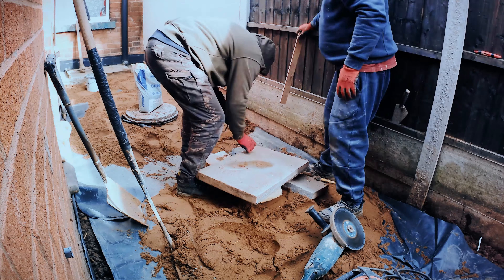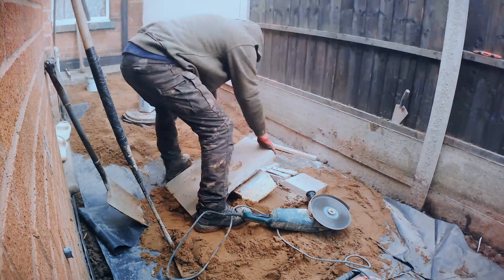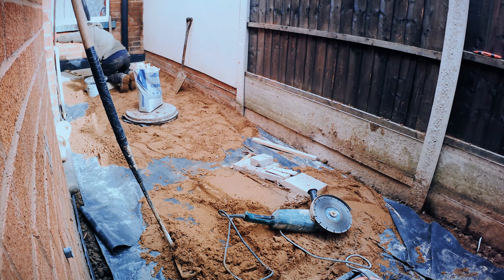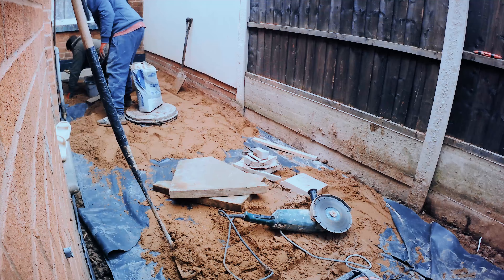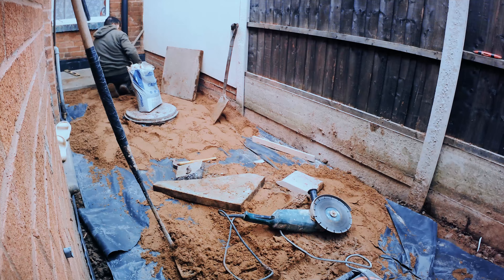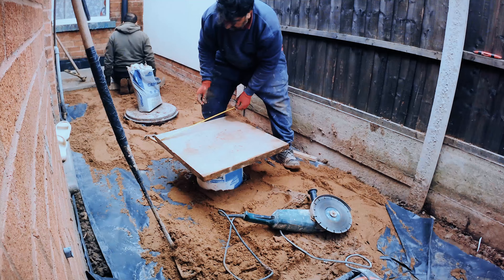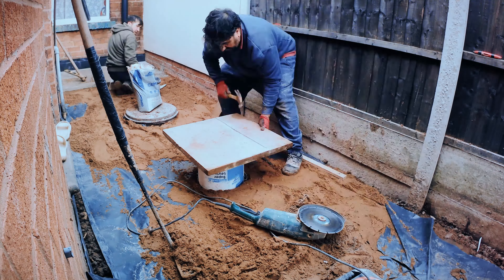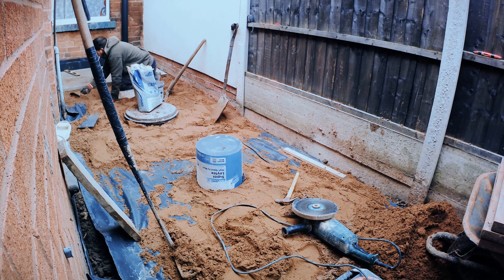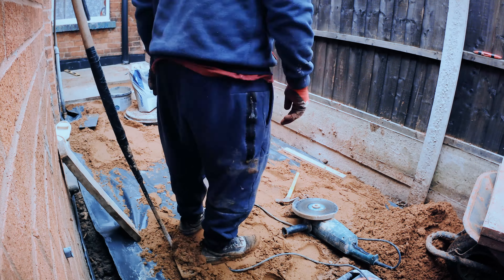If you watched my other episode where I showed how to brush sand cement mix into the gaps — which stops moss and weeds — that's a big help. Now you'll see the old wall along my house has a specific plastic layer which is higher than the slabs, plus a tile layer, and they're cutting slabs and putting them up against the tiles. This means any rainwater that flows will not be in direct contact with the wall, which stops the wall from sucking up moisture.